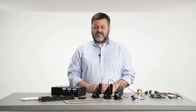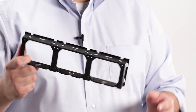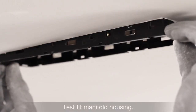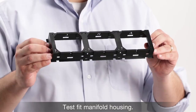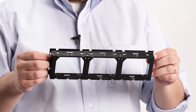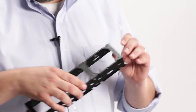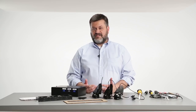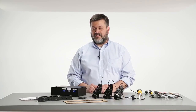Once the aperture is cut out, we recommend that you test fit the manifold housing into that opening to make sure the aperture is big enough for the installation and that you don't have any large gaps you'll need to mud over later. The same aperture is used for either a flanged or flangeless installation, so it's the same template included in both fixtures.